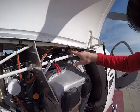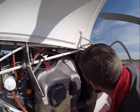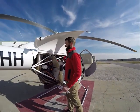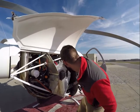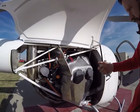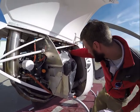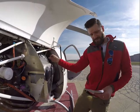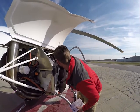Clutch solenoid looks good. No oil leaking out anywhere, and clutch actuator looks pretty good. We'll check the inspection flap right here — it's a hard-to-reach place, but we're pulling this inspection flap down and we'll be checking our main rotor gearbox oil. Looking right back in here — main rotor gearbox oil all looks good. And while we're back here, we're also checking our chip detector, which looks good. It's probably the most awkward place to get to. Inspection flap goes back down.